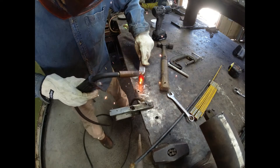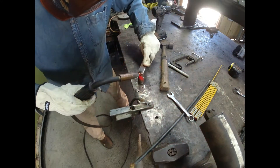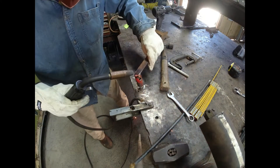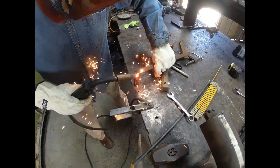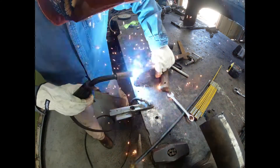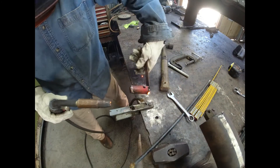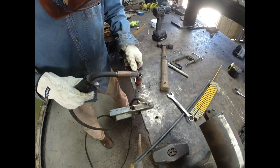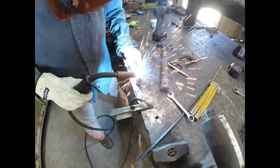This is my fabrication for the operating nut to clamp down the tool post so it can swivel and un-swivel. When messing with little bitty pieces of steel it's always easier to weld from the big piece and then cut it to size after. This is just a cap to keep dirt out, and I flipped it over and put a little more weld on the nut, which is what's going to clamp down the swivel.